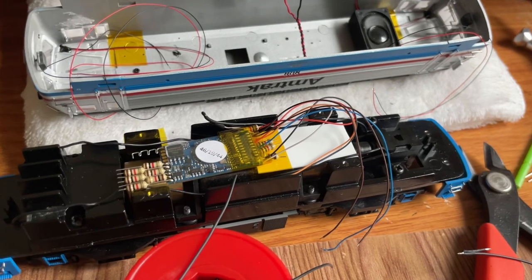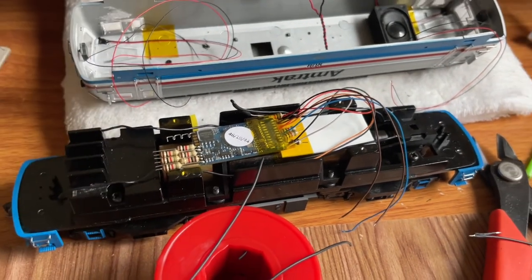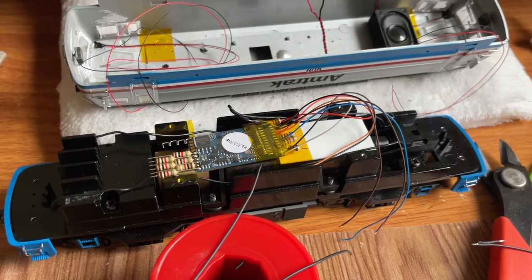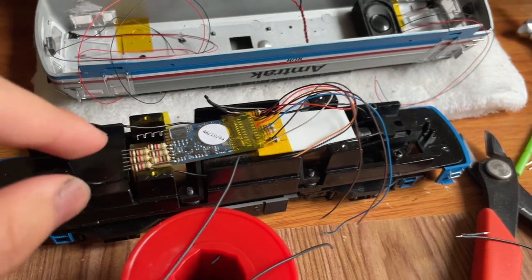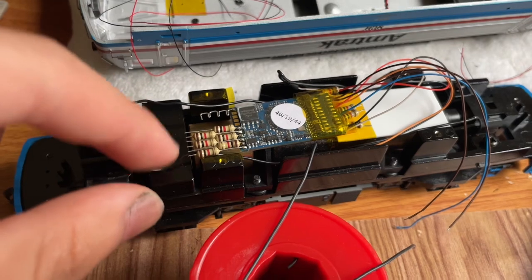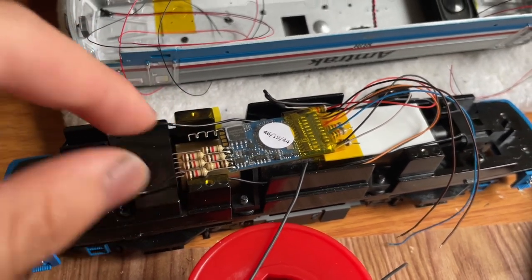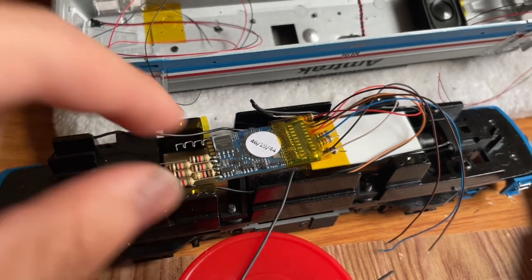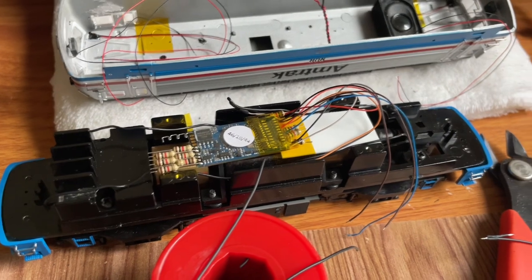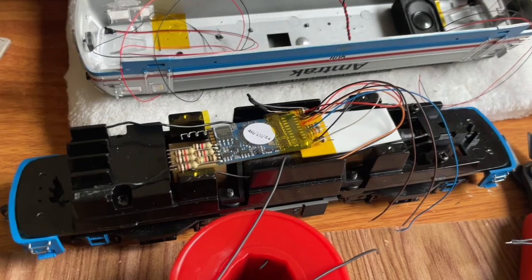Because I have 10 or more lights, all of their red positive wires have to be connected to the blue common wire. This one little soldering pad is supposed to accommodate all of these blue wires. So I created this squiggly shape so I can solder four individual wires onto that one spot, which makes it a little bit easier. I also have another blue wire I can solder other things to. It's a very complicated decoder install currently and I'm still working things out.